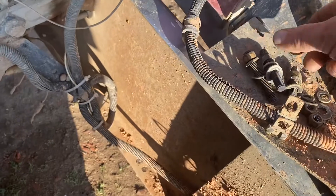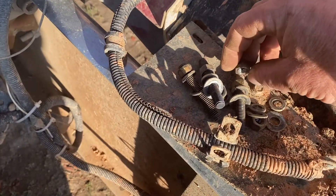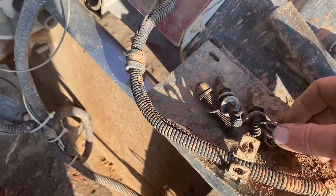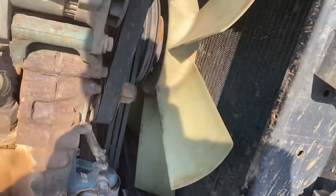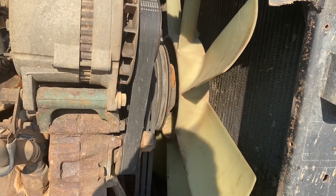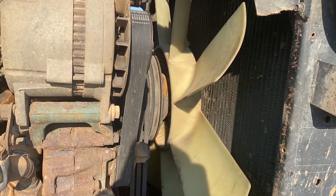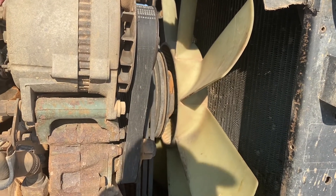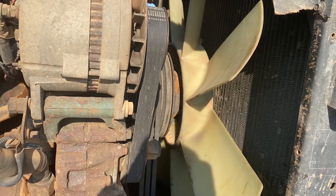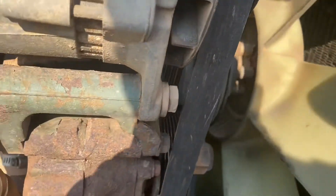There are six bolts, not four. Some of them come out with the studs, some come out with the nuts. I'd suggest if you're going to be smart about it, find the nut that fits and double-nut those so you can get the studs out — it'll give you more clearance. When you call up to the Peterbilt dealership and tell them you need a Horton three-belt on a '99 379 and they ask what the hell you're talking about — what a stupid world we live in. Anyway, bolts are out, fan's coming off.